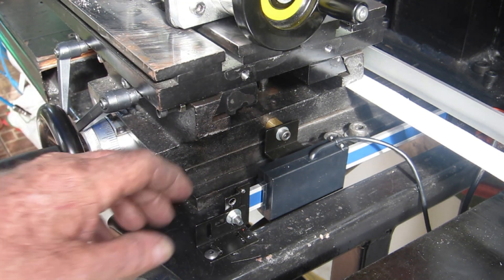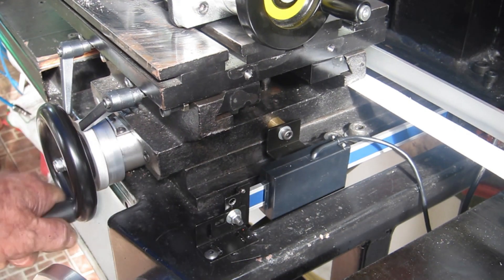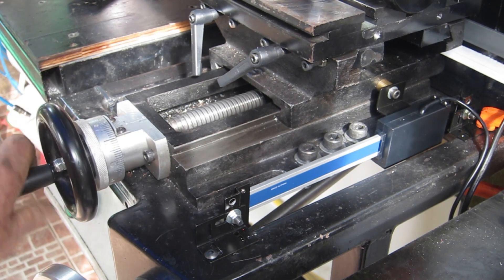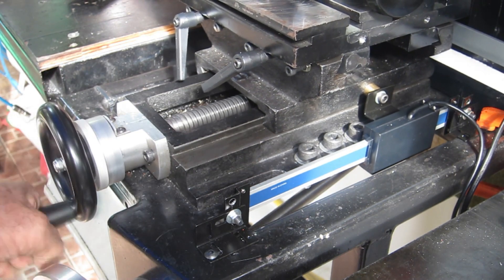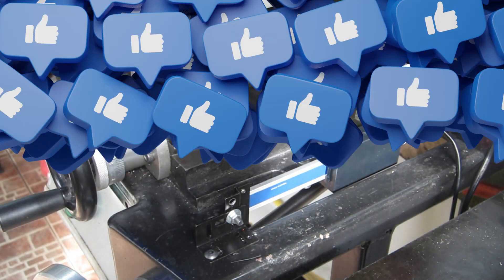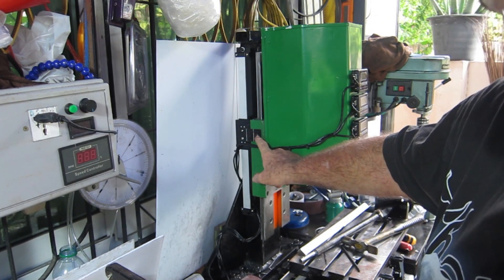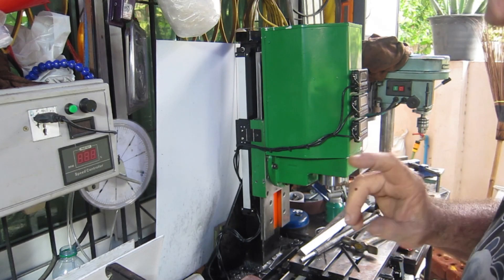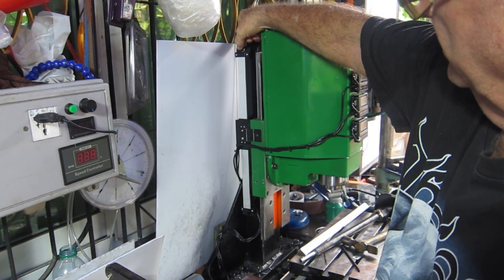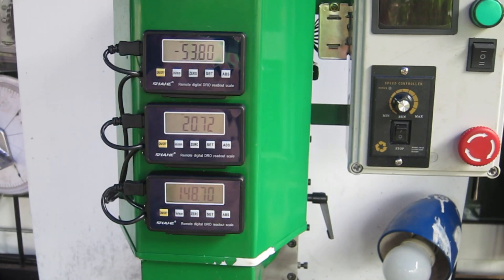That was all a bit too easy really. A piece of half-inch round that I ordered the other week came in handy to make a spacer in there — works really well, no problems at all. That bracket clears the bolts, everything clears the bottom of this and the top of that, so everything is good. The z-axis was almost too easy as well — I just straightened out the little z-bracket they supply, and up here I'm only fixing the bottom, using a longer bolt with a nut behind it to lock it and moved it in and out until it was in the right spot.